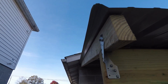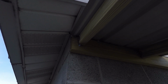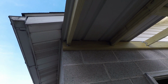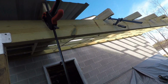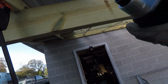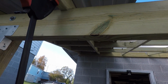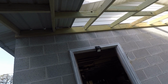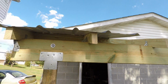I'm just trying to get this set over here for this offset. As you can see, that main one up there, I set the rafters in because I wanted this drip edge, so I'm just going to center that lip over the center of the edge of the board there. I'm not going to put up another panel to see if these bottom edges are squared up. You'd probably do that on a wooden building, to make sure they're not stepping out, like if it was crooked like this. But I just want them up against that masonry, so I don't care what that outside looks like. I just want them as close up to that as I can get. Okay, I got the one on there.